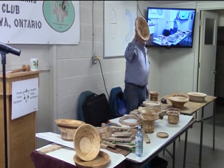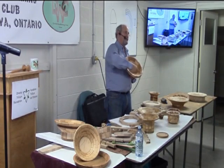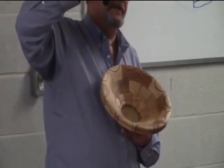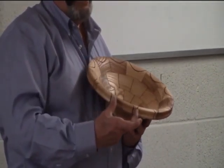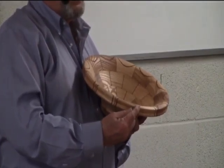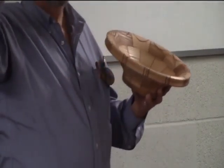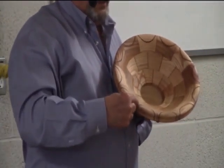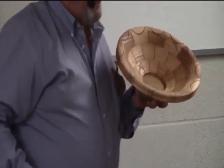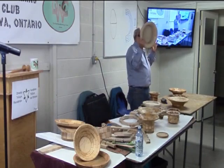I want to talk about this just for a minute. These wedges that I've glued up here started out as one-inch thick pieces of oak — I believe they were two inches wide, an inch thick. This dimension right here is the segment length, and that's what dictates the size of the circle. There's a formula for figuring that out. I wanted really perfect circles all the way around, and I've done this before with a bandsaw, but sometimes some of the circles aren't quite round — with a bandsaw I can only be so accurate.